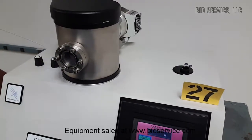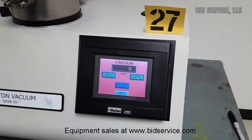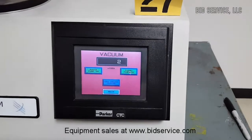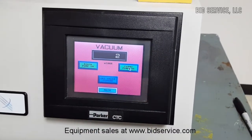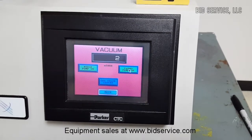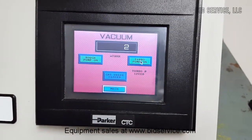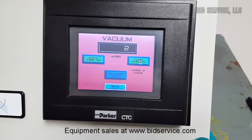It is less than almost 3 minutes and the turbo pump is still accelerating; the vacuum level indicated is 2 mT. Once the turbo pump reaches its full speed, there will be an indication: turbo at speed. Right now the turbo at speed indication is on. For day-to-day operation, we pump down with the turbo for about 20 to 30 minutes before starting the actual process.